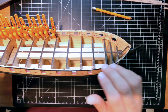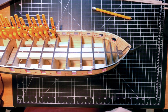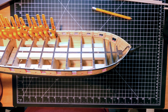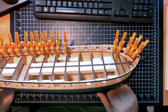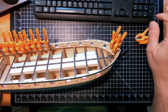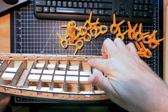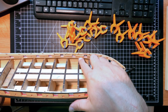Get it so it looks nice, then take the bow piece and fit it to the joint for the stern. Just to work out mid-ships, it'll be nice and smooth. I'm going to come back and sand this whole thing smoothly on the inside before I paint it anyway, but still you might get it as smooth as you can and as nice a curve as you can. We're about halfway through getting the planking on this port side bulwark, and I thought I'd kind of explain what I'm doing here. Using every clamp I have at my disposal — let me get these out of the way.